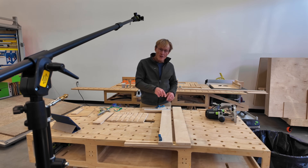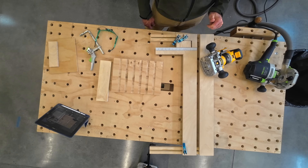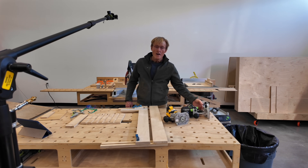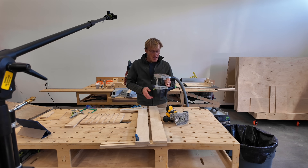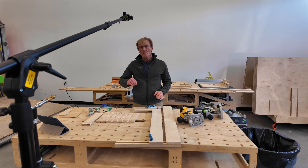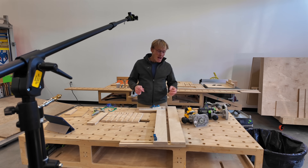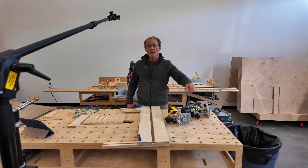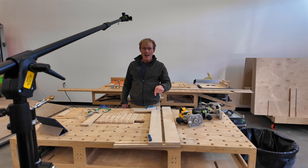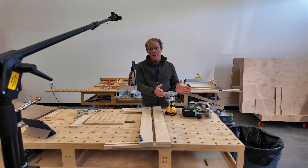The most important trick or feature that this jig offers is that it's router and cutter agnostic. It's not built to work with just this DeWalt cordless with a quarter inch bit or with this Festool half inch with a half inch bit. It works with either one, anything in between — Makita, Porter Cable, Milwaukee, it doesn't matter. It doesn't matter if the cutter is a quarter inch, three-eighths, five-sixteenths, or half inch. I'm going to get the same cut every time because I designed it to work with the bushing, not the bit and not the router.